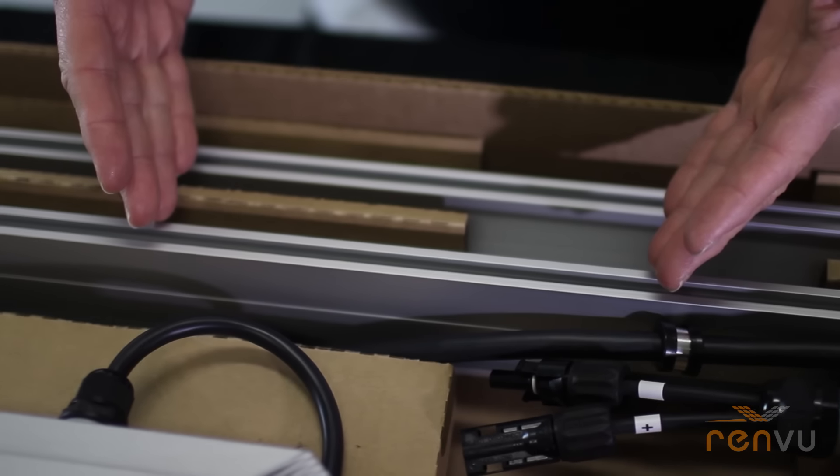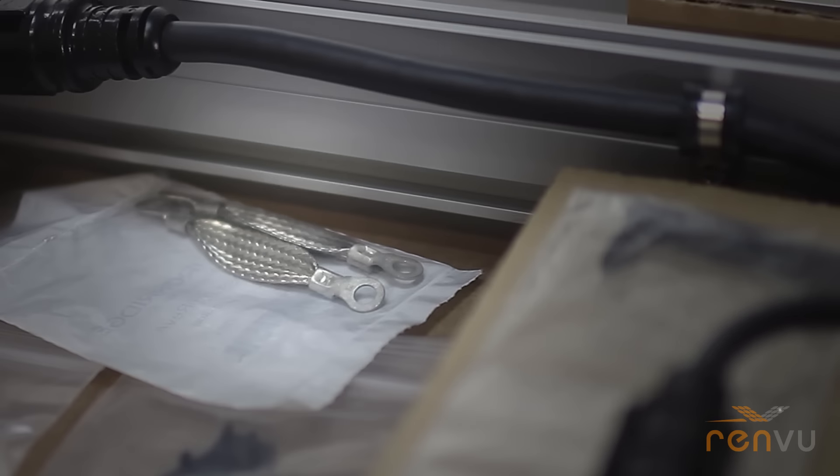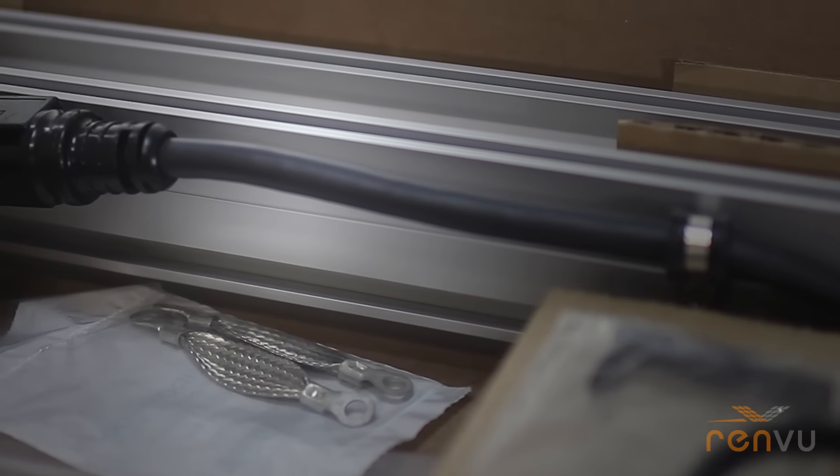The microinverters are limited to 16 per circuit, but you can have as many AC Rack rails spliced together as you need. The roof mounting components are roof or site specific, and the mounting clamps for the modules are module specific — those need to be acquired.